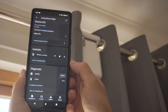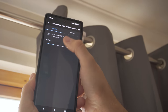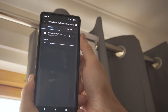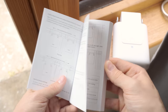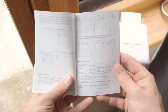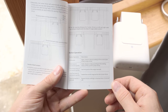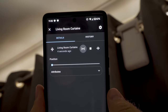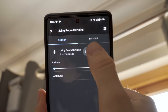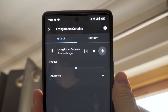I've already figured out a custom quirk to fix the battery life and direction reversing, and put in a pull request into ZHA, so you should have full functionality in ZHA really soon. I imagine Zigbee2MQTT will be updated very quickly to support this device as it usually is. Also, the physical button on the front can be used to set the physical limits for open and close, so you don't need the Aqara app for that. Once added to Home Assistant, they show up as covers and you can create a group so both units open and close at the exact same time.